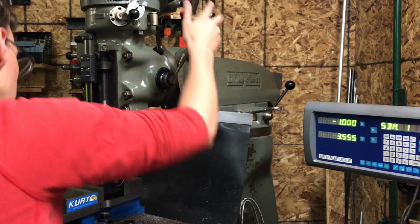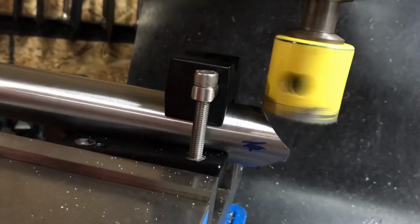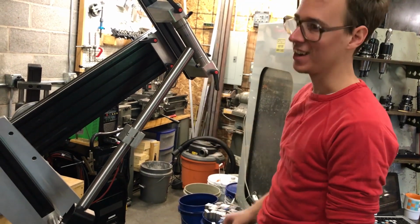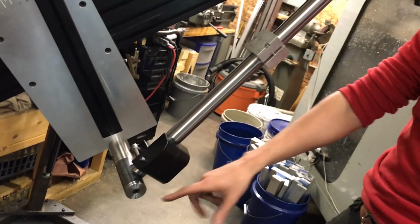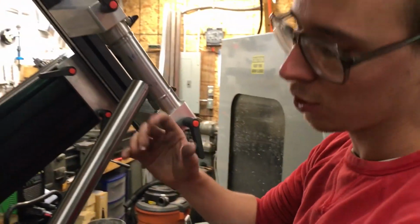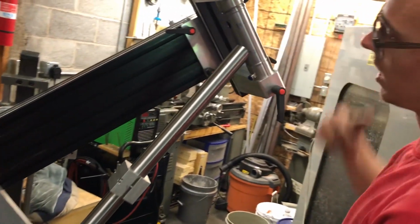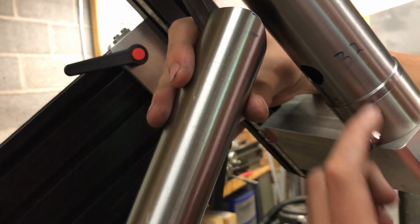Close enough. And so that'll cut a little bit shorter, and then we'll test it and check again. So I made another little baby cut. You know, this is a slow process, but another subtle cut on the end there. And what that does is it does a couple things. It makes the tube shorter, and it does move in that direction, but then it can drop further on the head tube. And so what I had done actually was to scribe a line here.